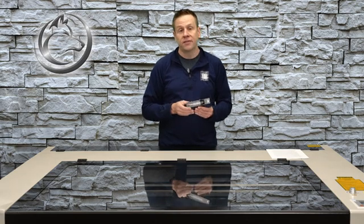If we make any adjustments we're going to count the number of turns on that side of the machine only, then once that looks perfect or close enough we're going to go into the other direction and repeat the whole process again. Just be aware that these machinist levels are crazy accurate, and if you're trying to get it perfectly centered, that might not be something you're able to do — if you're off a little bit, just know that it's still multitudes better than using a standard construction level.